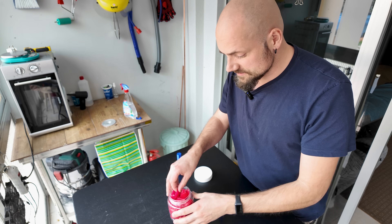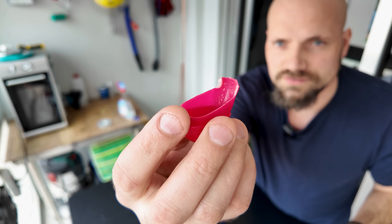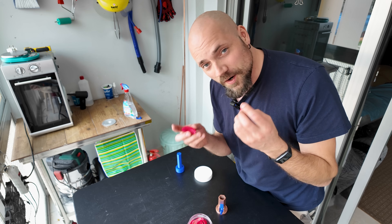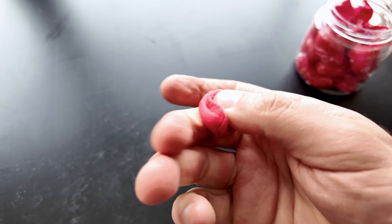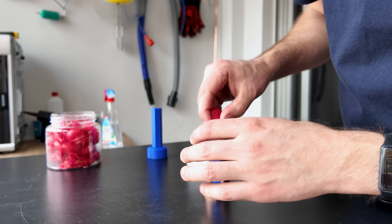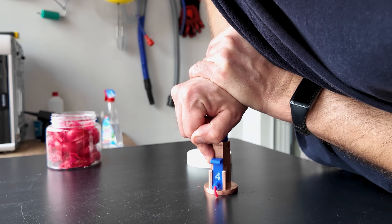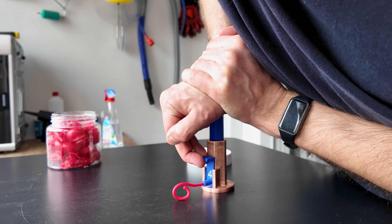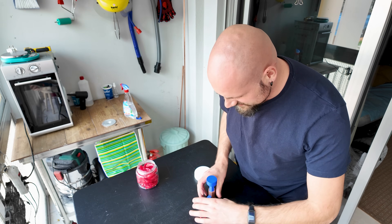There are two ways I like to make sprues with Babybel wax. First, take your wax and remove any white residue. Here we have wax from two Babybel cheeses. Let's see how long the sprue will be if we use a 4mm nozzle. You want to work the wax for two reasons: to warm it up and to mix any residues so it's more even. Now we just press.